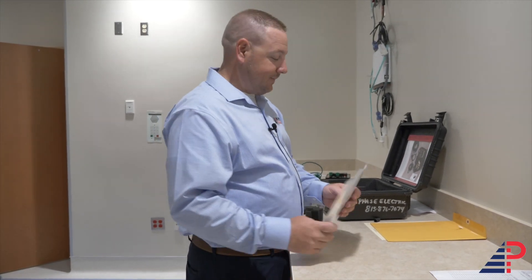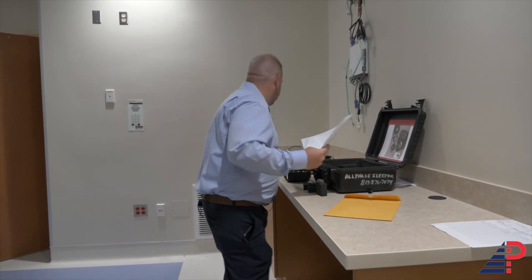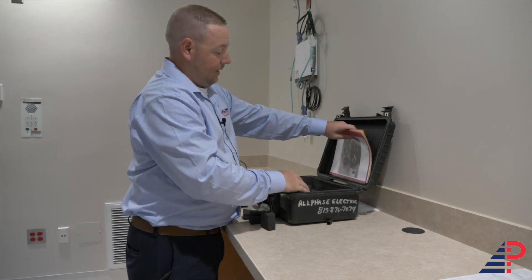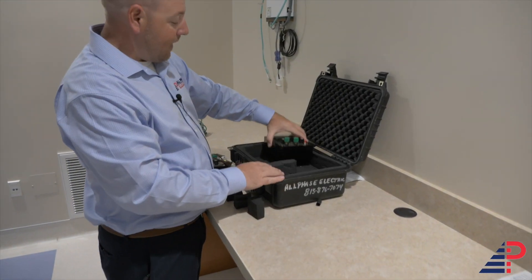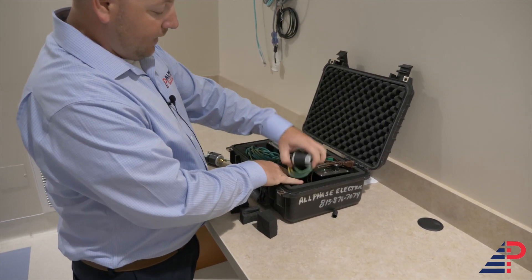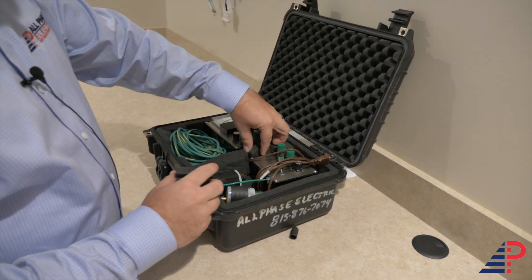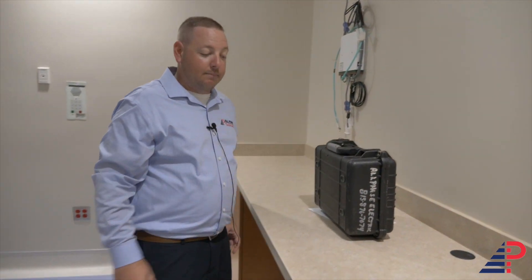When you're all done testing and done filling out your paperwork, give it to your project manager to type up for the AHJ. Put your calibration certificate back in the manila envelope, fold the three laminated direction sheets back together, lay them on top with the booklet, and place them in the case. Put the foam piece back in, then put the meter back the same way you found it — MVO 1PB there, MVO IT on this side, long lead coiled up neatly, short lead on the side, 30-amp twist lock next to it. Put the extra foam pieces between the two pieces of equipment, close it up, and send it back to the shop. Thanks guys!